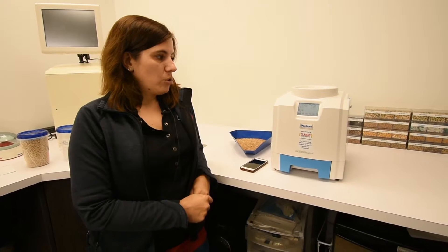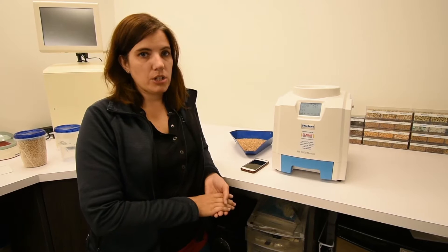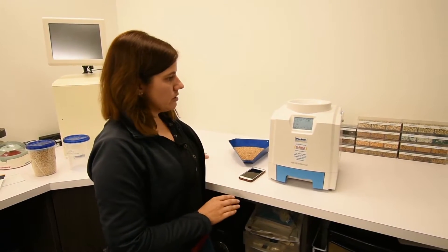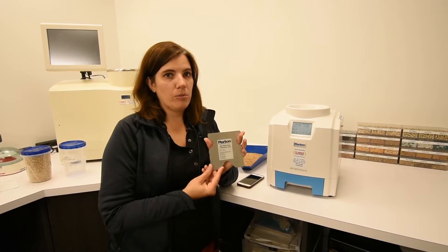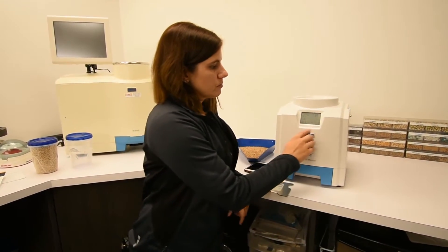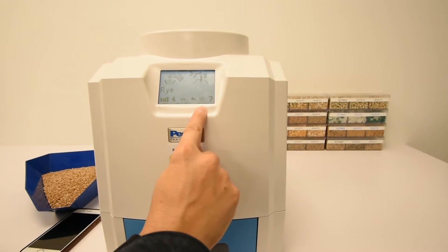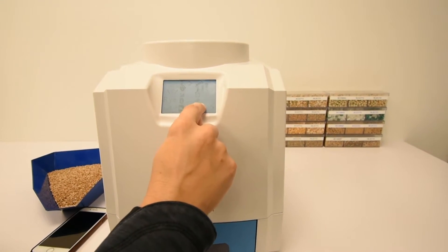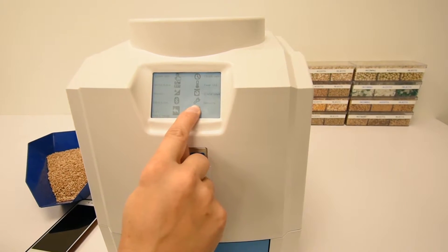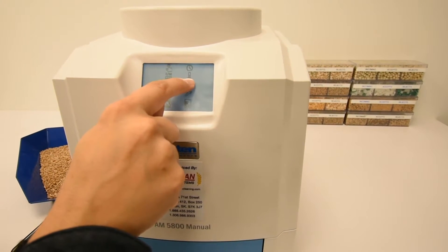The other thing to check for is your scale. You should be checking this regularly, but making sure especially at harvest that it is reading correctly. How you do that is you need your calibration tool which came with your unit, and we will do this under the tools menu. The tools menu is this gear on the bottom right hand side. You tap on the gear and your menu will come up. If you press and hold the question mark, the menu options will appear. The scale check is on the right hand side and the third option down.